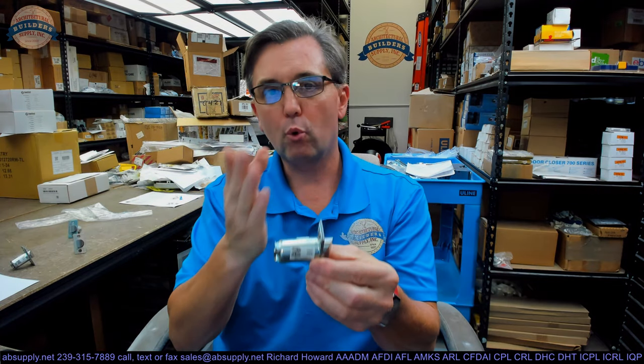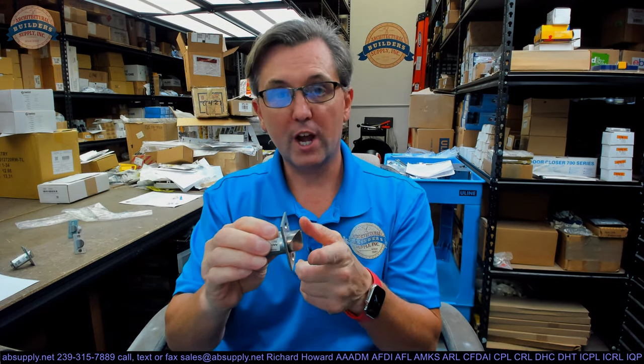It's not unusual that you'd be looking at this product. Be mindful: you either need beveled or square edge, and half inch or three quarter inch projection. Probably half inch — that's going to be it almost all the time — but you don't want to get trapped in an application where you require a three quarter inch latch bolt throw. Yale doesn't charge as much of an upcharge as other manufacturers do; one manufacturer in particular has an extremely high upcharge to get that three quarter inch throw latch extension.